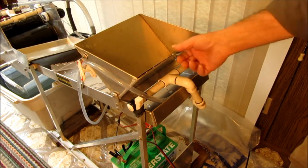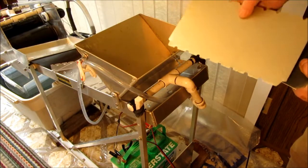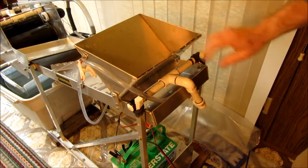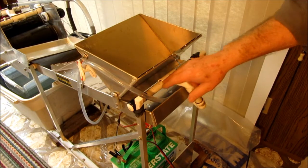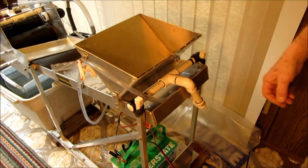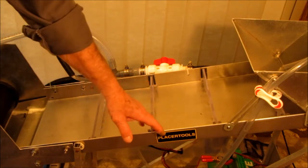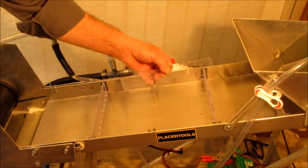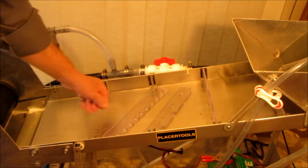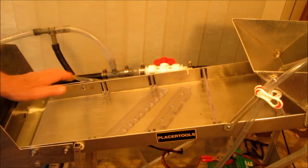To start with, you have a hopper. It has a flat edge plate for a blanker, and a second one that has different size holes in it to process different size material. There's a flat plate under here that the spray bar will squirt water at, and it flows up in there — it basically promotes material in the hopper to flow down into the tray. The tray is 10-inch aluminum. It has four regulators; the upper three are identical, and the final one has many more holes and slots in it, which helps even out the material as it flows and prevents surges from overwhelming the magnets.